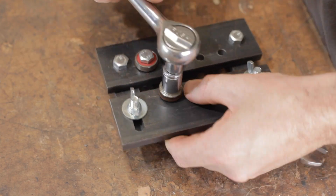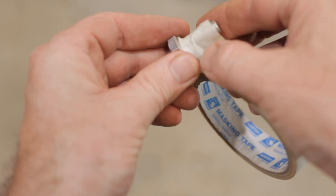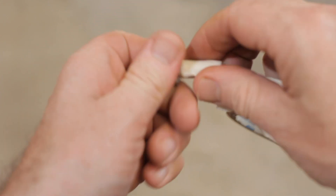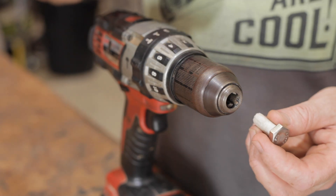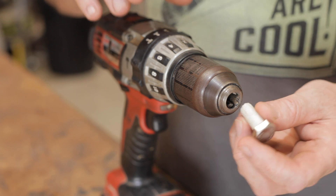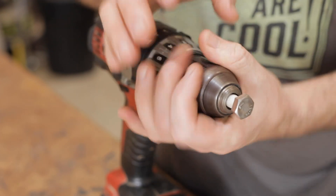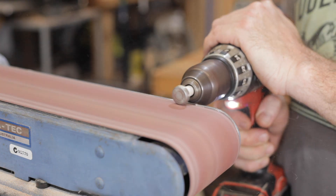Now we're ready to prepare a thumb screw and give it a go. I put a bit of tape on the threads just to protect them. The ones I've made so far — to turn the head round I've done that on the drill press and used an angle grinder and a file then sandpaper until it's polished up. This time I'm going to try something different: I'm going to chuck it up in the cordless drill and grind it round on the belt sander. You don't need to chuck that up too tight — you don't want to damage the threads on the bolt.